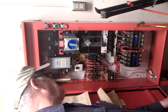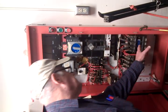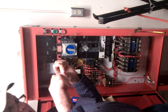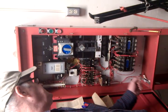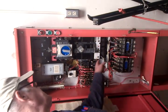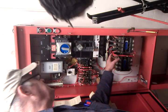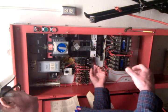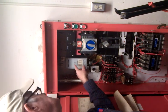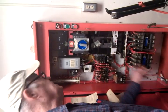Say the motor is locked, say the pump is frozen up, or the motor's been locked in place — you have these things called CTs, current transformers. This is measuring each leg, each of the three phases. If the motor is blocked or tight, these things will go up and trigger locked rotor protection. This will trip it out — like a thermal — it'll drop your circuit breaker.